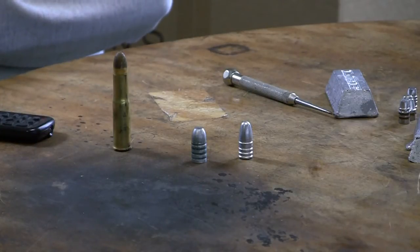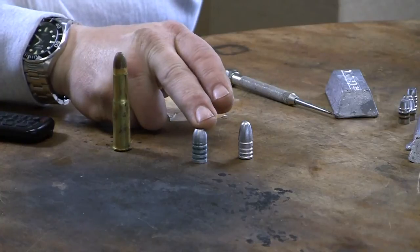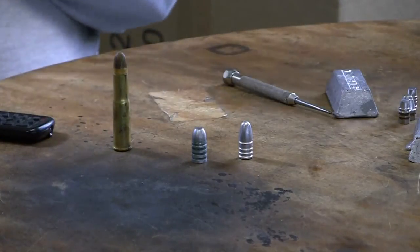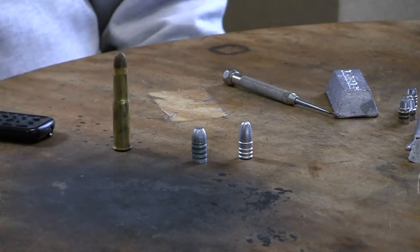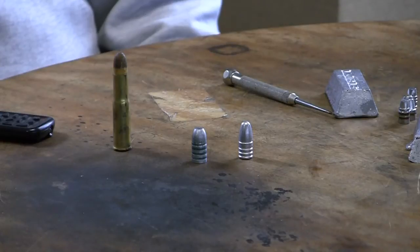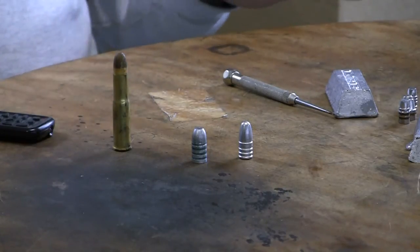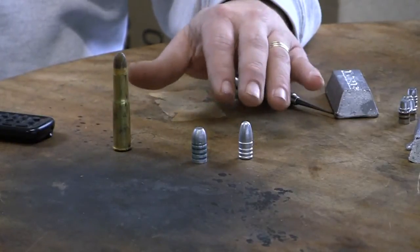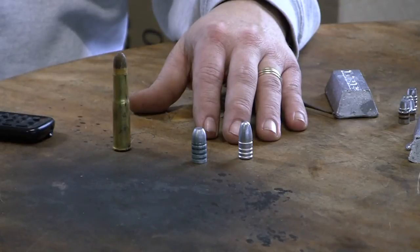Based on the limited work I've done, I'm going to stop using these wheel-weight bullets with smokeless loads and go specifically back to black powder with the correct lead alloy. I've already blended some — actually about 19-to-1, 19 pounds of supposed pure lead with a pound of tin. That's close to the 20-to-1 ratio that's recommended and that I believe the government used at one time. I've read some books on this and we'll do a book review. So I've shifted gears on the black powder cartridge approach and I'm going to cast bullets from a softer lead alloy.